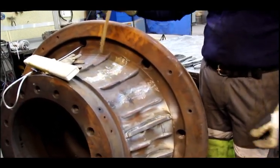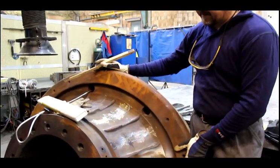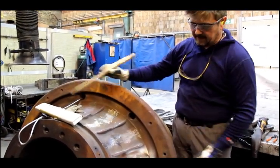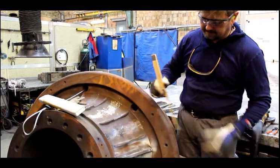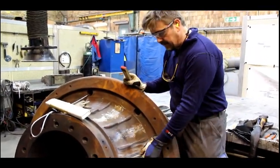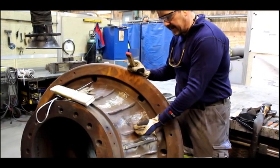Because the wheel is made of cast iron, we need to preheat the whole wheel to 300 degrees before we weld it, otherwise the welding will crack. So it's easier next time to replace these wings than repair the old ones.